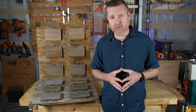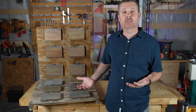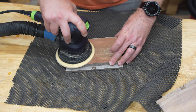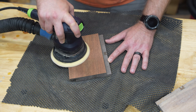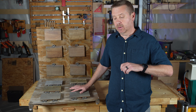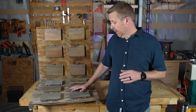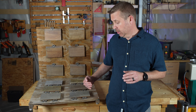So here's what I'm going to do differently. If this was your decking or your siding, obviously you couldn't just throw this away — this is a big investment. So we're going to sand each piece down. I'm going to use 40 grit, then 80 grit. We don't want to go much finer than that because we don't want to block off the pores — we want that oil to really soak into the wood. I'm going to apply one coat, wipe off the excess, then apply another coat and wipe off the excess. Then I'm going to wait 48 hours and do the right half of each board with a second coat after the first coat has dried.